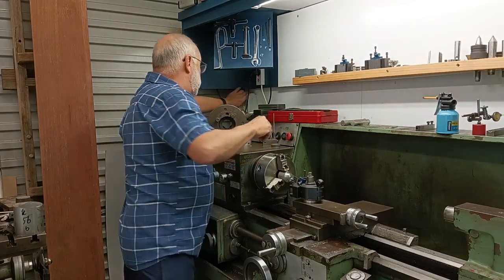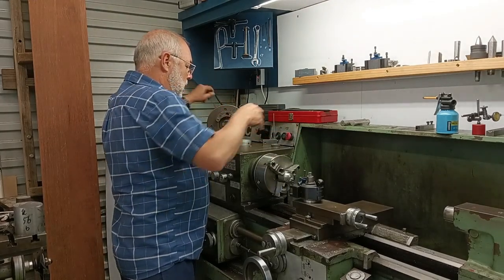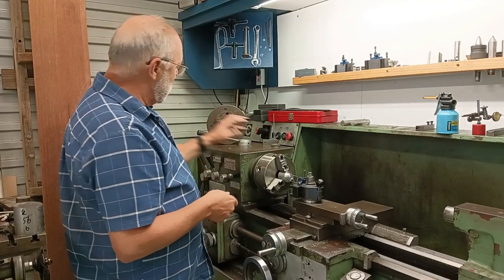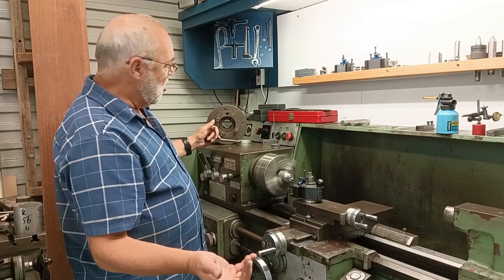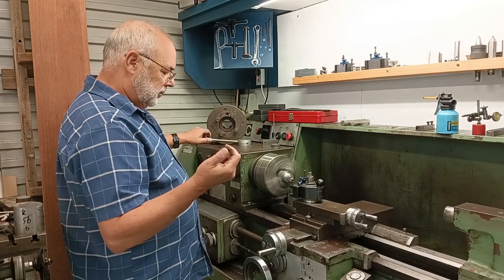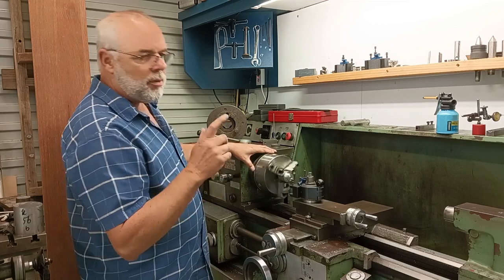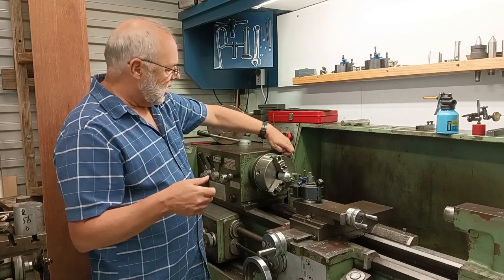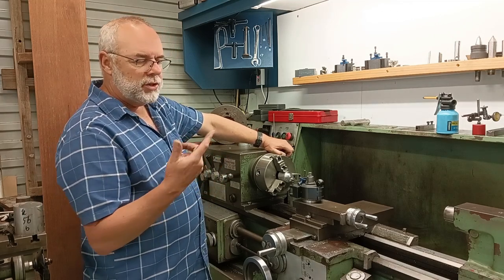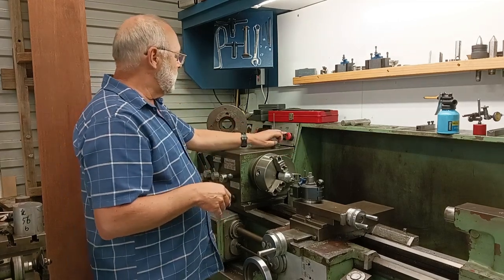When you turn this on it's quite — well, there's a gearbox — the clutch does need a little bit of adjusting. It's a wet clutch inside the gearbox. When you engage it that way it goes forward, and of course you can reverse it by going the other way. I do understand there's a little bit of a problem with the layshaft bearing to the gearbox — I think it's a bush — and a friend of mine with a similar machine had to convert that over to needle roller bearings to keep it going. I'll just turn that off because it's a little bit noisy.